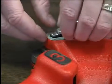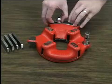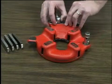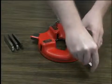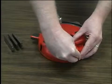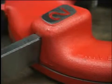Lift the tongue of the lever washer up out of the slot under the size bar. Slide the throw-out lever all the way to the end of the slot in the over direction indicated on the size bar. Insert the dies to the mark on the sides of the dies. Die numbers 1 through 4 must agree with those on the head.